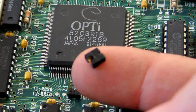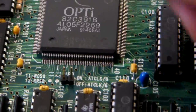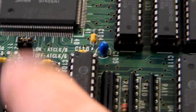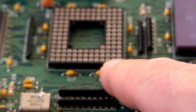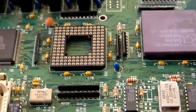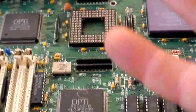This is what's known as a jumper - or if you're Irish, a gansey. That little jumper, depending on whether you have it on or off, allows the AT clock to be at 8 or 6 MHz. I left it at 8 MHz. I installed Command & Conquer on this machine, and I also had an Intel 387 33 MHz co-processor running along with the main processor, which is AMD, and ran Command & Conquer at an acceptable level. I didn't do it to play the game since I had a Pentium 120 at the time, but it did let you do it.